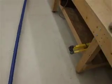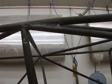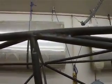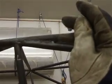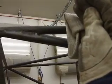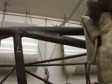And the way it works is if you're welding on a cluster, for instance, that has a real long weld, or any cluster really where you're going to be putting in heat, you'd have your hand here holding your TIG torch, and you always rest, or I was resting part of my hand on whatever I was welding on to help steady it, and this kept my finger from burning.